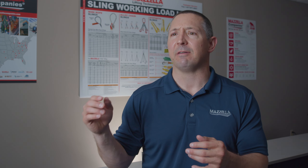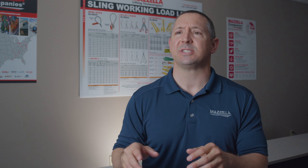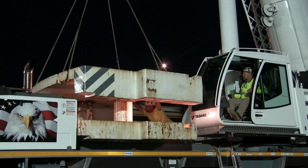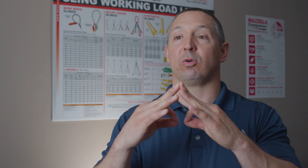There can be other 45 or 30 degree working loads on there, but for the most part 60 degrees is going to be the basic sling angle that we want to work with in any field — whether it be industrial, manufacturing, construction, anything. If you measure in between your pick points and you've got the same distance going back up to your crane hook or common point, you have a 60 degree angle and you're good to go.